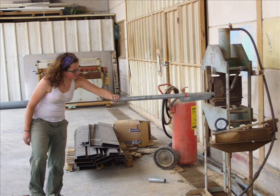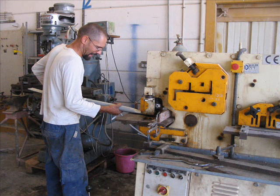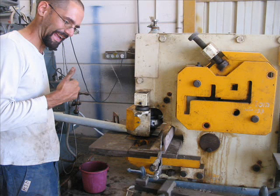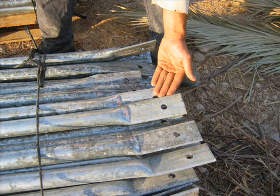Once the end has been flattened, which is done by using a foot operation, it's slightly bent upwards to create an angle. This angle will be creating the contour of the dome itself. Next job is to go back inside and use the punch. This punches a hole clean through the metal and it's a really dangerous machine so you better watch out — get your thumb out of the way or any other appendages. What you should have when you're finished is something that looks very much like that: accurate holes and as you can see by the pole at the top there's a slight bend.